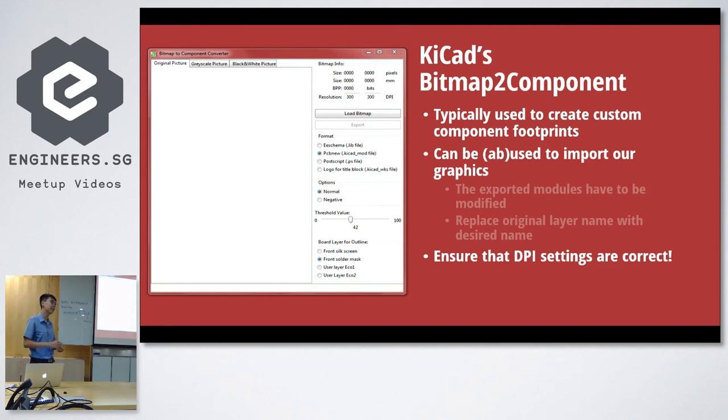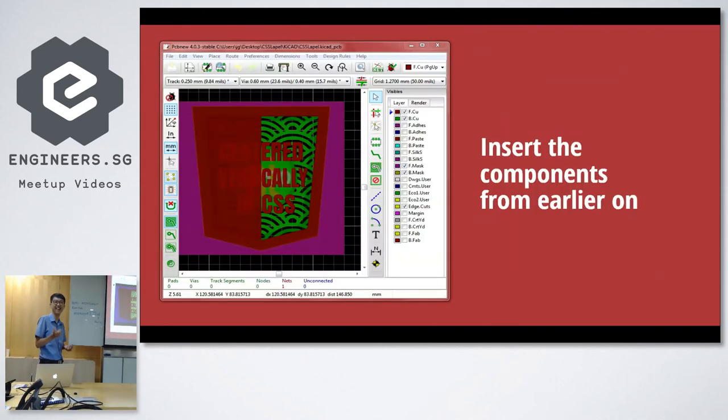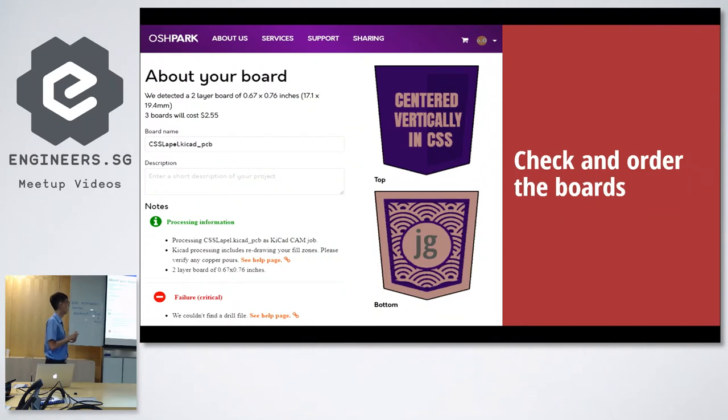You also want to take note of your DPI, because if your design is at 4K by 4K and you want it to be a certain size, you have to do the math — if you do it wrongly you get a really big lapel. When you're done with your components, just open your schematic editor, your PCB editor, and stack everything on the same spot, because you're done with the hard part. Draw the board outline, save it, and your board house should be able to understand it. Just to be sure, I usually check it online using OSH Park, a US board house — very nice. Their website is very good; even if you don't buy from them, you can use it to check your board. In the end I'll usually buy from them — this design in my hand, three of them cost me $2.55 USD shipped. It's cheaper than China, the quality is really good. They use gold plating on exposed copper layers, whereas in China they use tin, but here they use gold which is very shiny and doesn't tarnish.